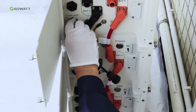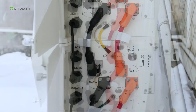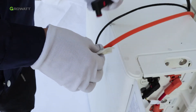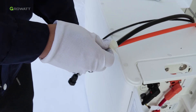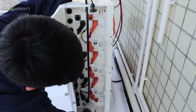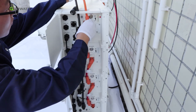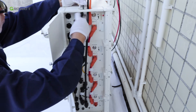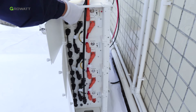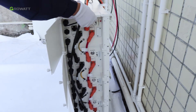Connect the communication cable from the link-out port of the top battery pack to the link-in port of the next battery pack, and connect all of them one by one. Power and communication cables from the hybrid inverter need to go through the rubber cover. Then connect the negative power cable to the BAT-minus port of the bottom battery pack, the positive power cable to the BAT-plus port of the top battery pack, and the communication cable to the PCS port of the top battery pack. Finally, put the rubber cover onto the partial top cover.